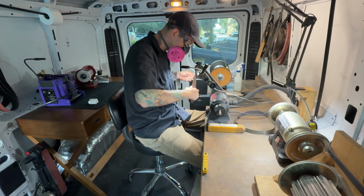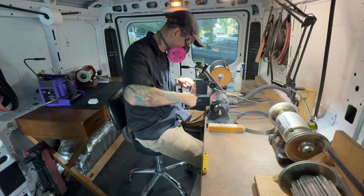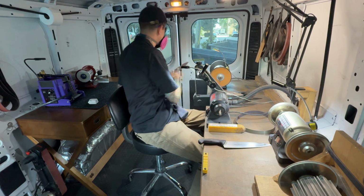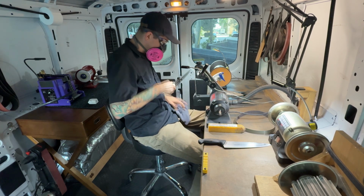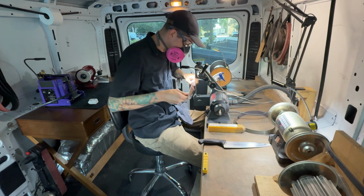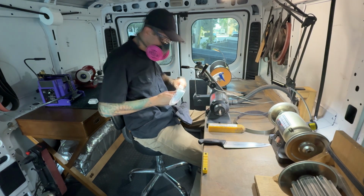I think there was about 15 regular straight-edged knives on this stop, and so I'm going to be going through them very routine. I'm going to do the first step on all of them, which will be profiling and apexing them using the 120 grit ceramic belt on the 1x30 there. Some of you may be familiar with the method that I use. This is the method that I use for 99% of things now, is the kind of top-down edge trailing method on that low speed 1x30.